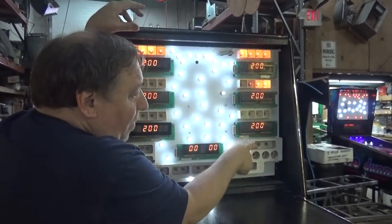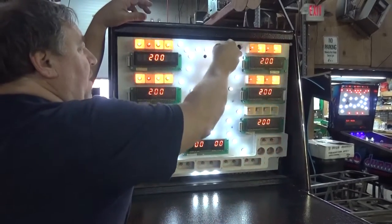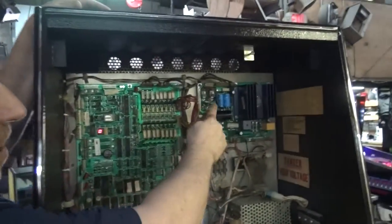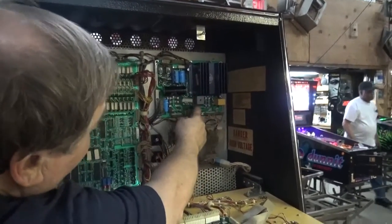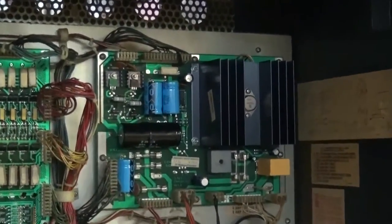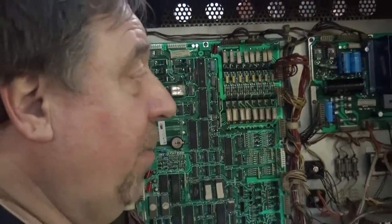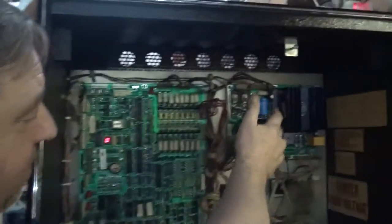LED lighting runs so much cooler and has no drain on power. Regular light bulbs we find work best for the strikes and spares scoring. All the displays are bright and clean, and that's because Frank - who's working the camera - changed all eight caps on the power supply. We've opened games shopped by others and found only one new cap in it. You can't do that because the power supply is 30 years old - you change them all. The caps are always your weak link.